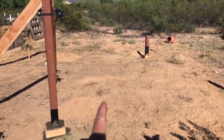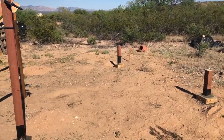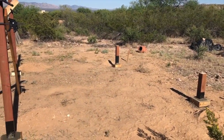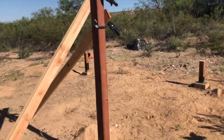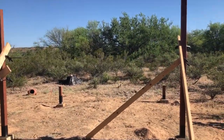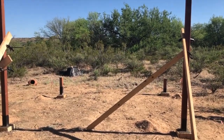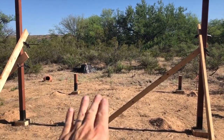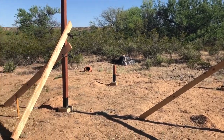As we put in these posts we made our measurements all along the way to make sure all our distances were right, including the diagonals, so it's all nice and square. All the posts face directly south — true south, not magnetic south. Looking at it this way, the panels are going to slope down from back to front at about 27 degrees. The sun comes up in the east and goes down in the west, so in the winter it'll be fairly low, but in the summer it's almost right overhead.